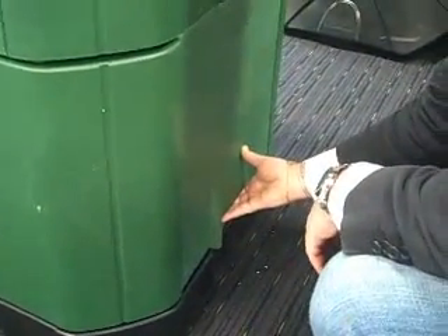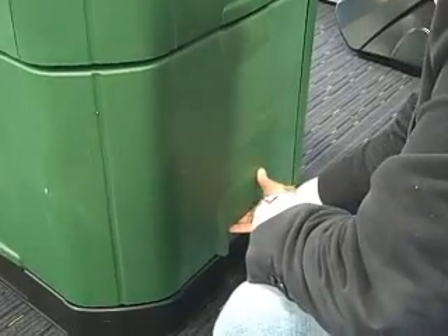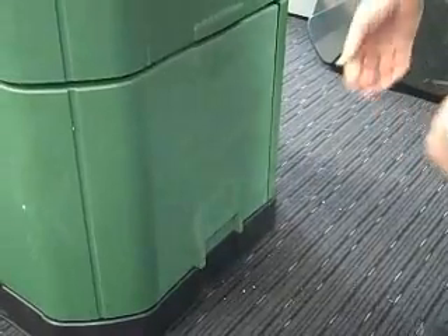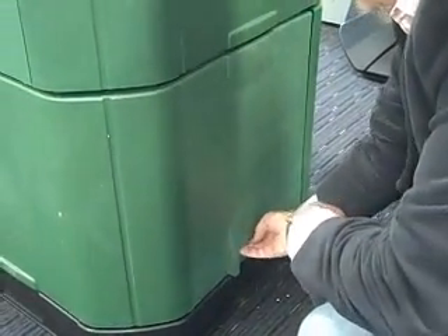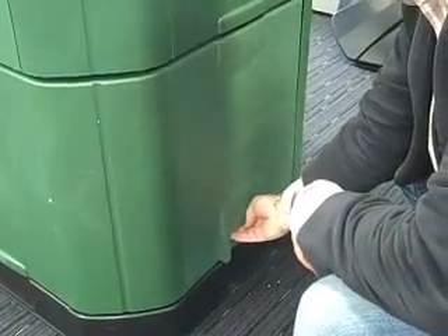The doors require an upward movement and out to remove, and an inward movement and down to lock the bottom of the door into the base, so that the biomass you're loading into the bin can't forcefully open that bin door. In the down position I can't pull that away from the base. The second door then goes on and down.